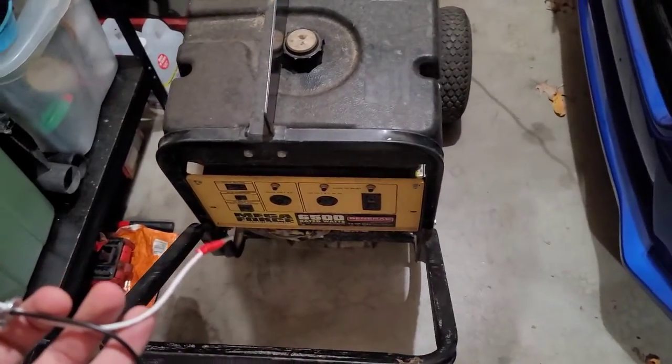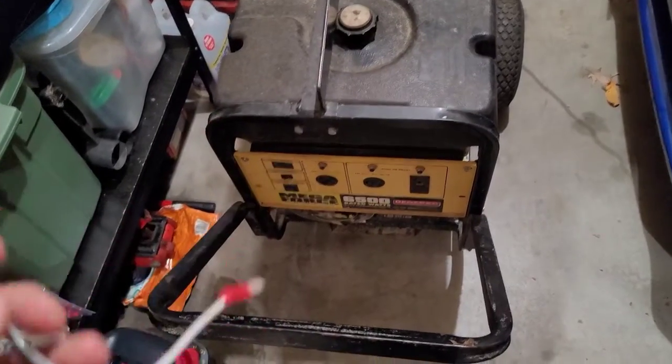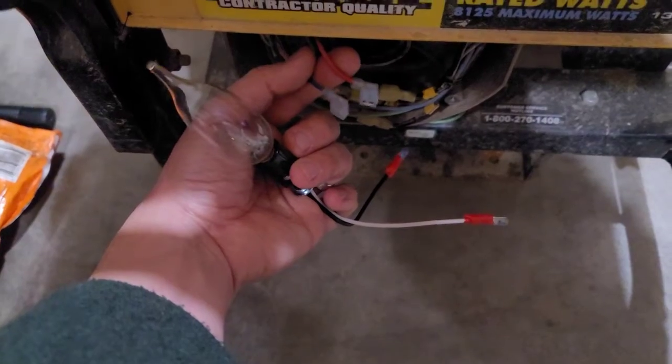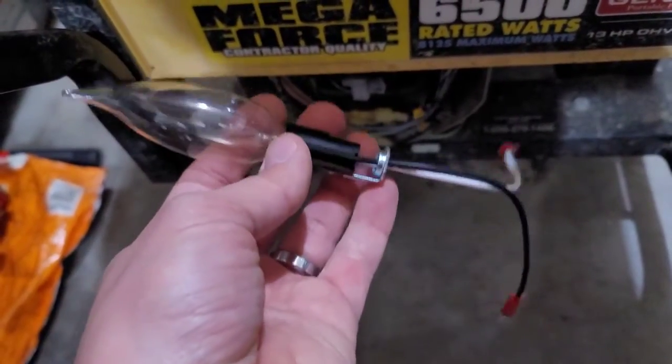And in this case, the DPE windings, it's not polarity sensitive. You can connect black to red to whatever. On this particular generator, the exciter windings are blue and red, but sometimes they can be both black. And all you need to check is to see, can it support a load?